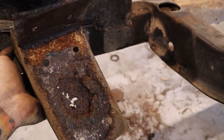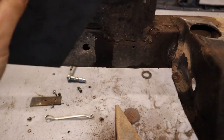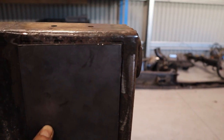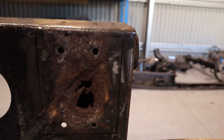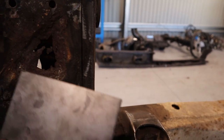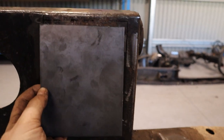Also on this piece here, it's rusted as well, so I'll have to cut out a square and re-weld a piece in there. Just cut this piece of three mil plate — I've just marked it out. I've stuck that on there and gone around the edge with a texta and marked it out. I'll cut this out and then I can use it as a template to mark the holes, then drill the holes and weld this piece in.